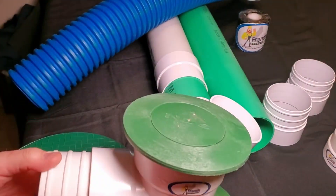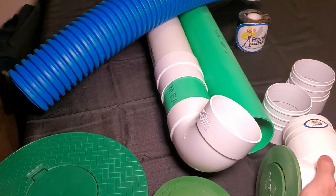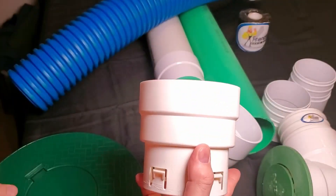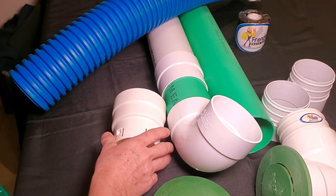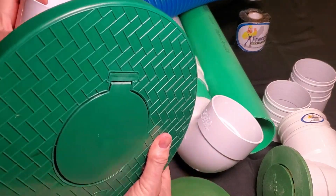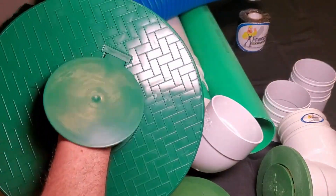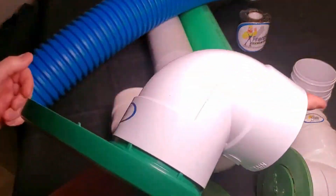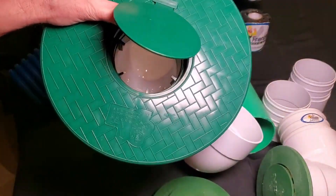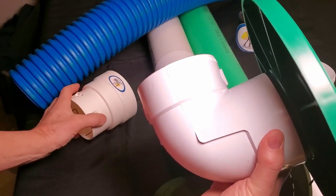I think that's a big inconvenience for the homeowner to have to dig this up and remove it. So that's why we started using a coupler that we refer to as a forever coupler. What we recommend is to always use a pop-up that you can get your hand down in. The idea is if there's leaves in this fitting and tree seeds, it's super easy to scoop them out. If you go with a pop-up like this, then you can use the forever coupler.